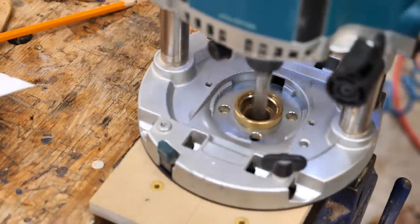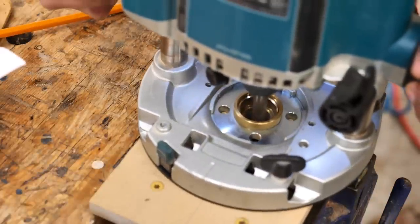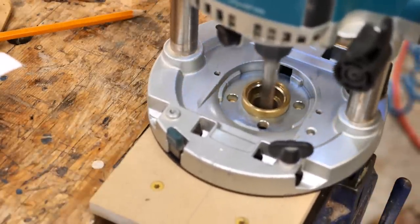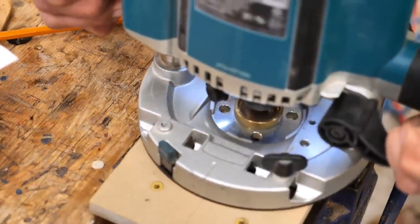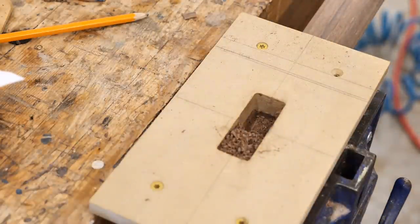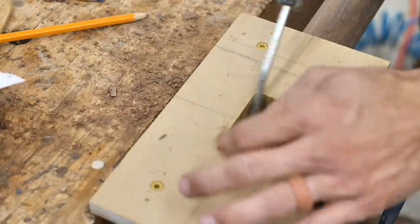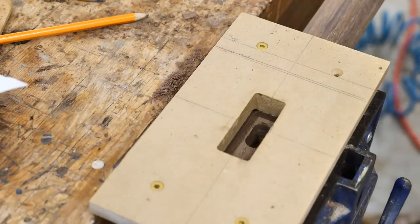Now, the two front corner posts have smaller tenons, so we have to overlap those because they're in the corner, or else they'd run into each other. So one tenon goes above the other one. You'll see in this particular cut, we shorten the length of our mortise so that we have one mortise going in low and, on the other side of the cylinder, one mortise going in high, so they overlap each other.